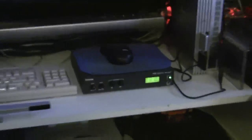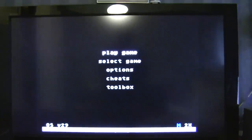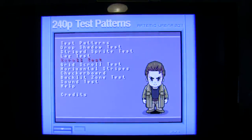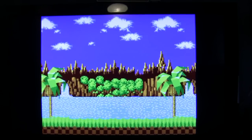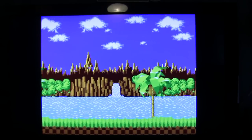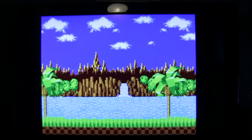This one doesn't have a 50/60Hz switch. Notice now that the vertical refresh rate is 59.9Hz, which is a lot closer to the NTSC spec — and that's significant. Back to the menu, play game, which should take us straight back to the 240p test suite and down to the scroll test. This time you'll see that the scrolling is smooth. You'll also notice that there are no lines cutting across the screen, so the problem is effectively gone.